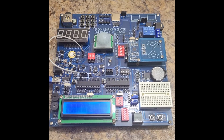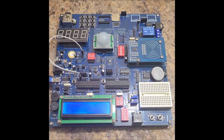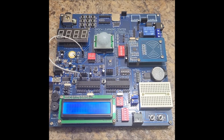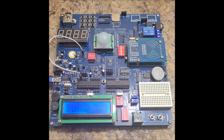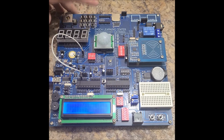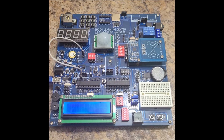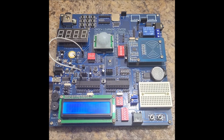And so next, how this works is there's a resistor divider. Now, that might be Greek salad to you if you have no concept, and that's why at the end of this campaign we're going to talk about it in the schematic review. But a resistor divider, you can Google it, and it's very simple. We have a very large resistor divider, a ladder, and each of these buttons is connected to a different resistor in that ladder. And when we press any button, it's going to connect that corresponding resistor divider value and send it to the ADCK pin, which is connected to chip A on the A3 line. And it's going to sample that.